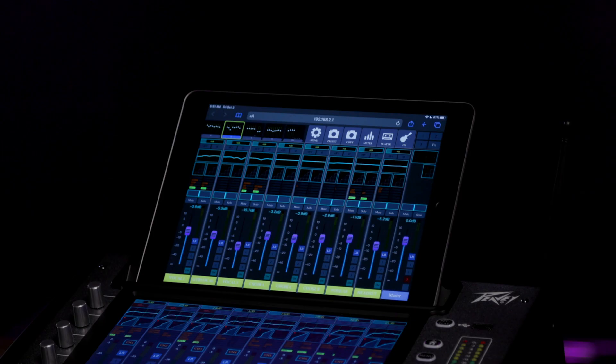Connectivity is important in a digital console because in an analog console, we're always dealing with a WYSIWYG environment — what you see is what you get. If I have a large-format analog desk and I have Channel 17 Aux 3, that one control does nothing its entire life but control Aux 3 on Channel 17. Digital consoles are not like that. We have to be able to have one control do many things. It does make the compact console possible, but it can be confusing. We need to be able to find where we are quickly, and one of the easiest things to do is to add a second display. If we were to add a second dedicated display, it would be rather expensive. So Peavey, along with a number of other manufacturers, have utilized iOS devices, such as iPads, to be able to extend the control surface, and the same thing applies here.